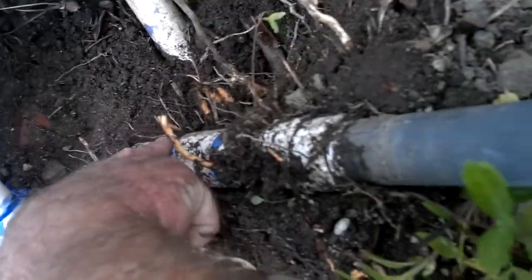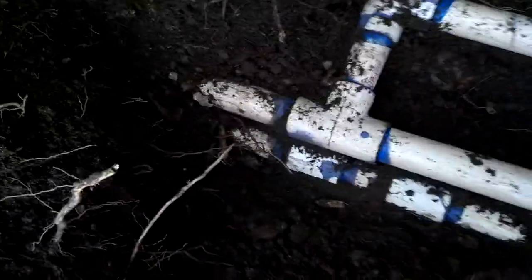I don't know why they used one inch for lateral lines — the main line is coming from here and it's buried very deep, which is good. This is the new lateral line. Check this out: there were two lines going for the same valve — one inch, for this not-so-big yard, and it's just one valve. So right here I had to fix this.